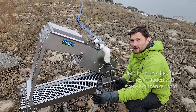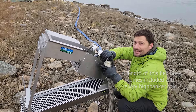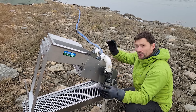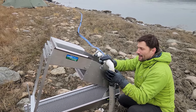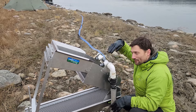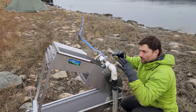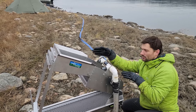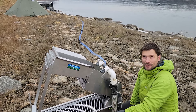I use a short length of flexible hose here. If your lay-flat hose isn't the exact perfect length, it still makes this really easy to hook up and set up. The advantage of this spray bar is you can knock it up and down with your shovel a little bit. Because it's all threaded, the more you have it pointed in towards the back of the hopper, the more it helps the material out of the hopper. The more you point it down at the front, the more it creates a wave that holds everything back, similar to a claw. Ultimate adjustability for any sort of gravel you're shoveling — you can even have one shoot up and one shoot down, and it kind of spirals around in there.